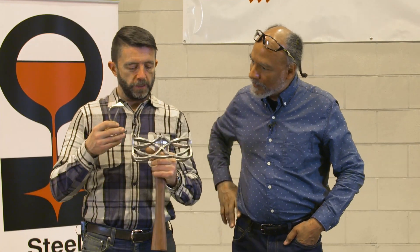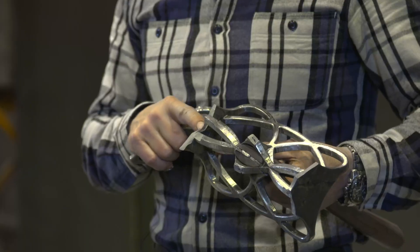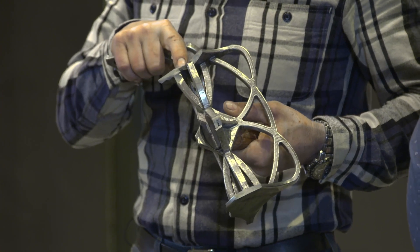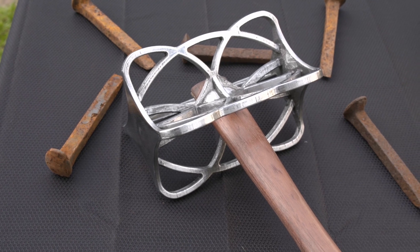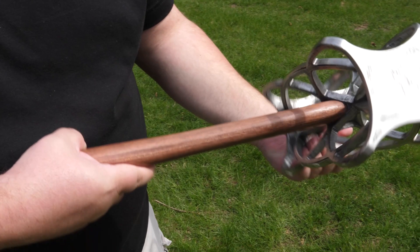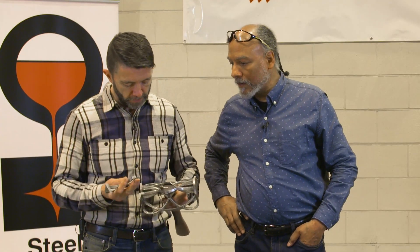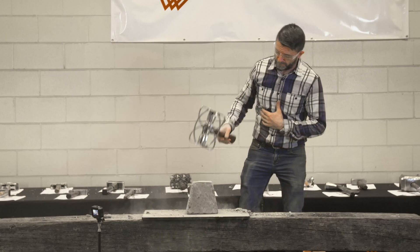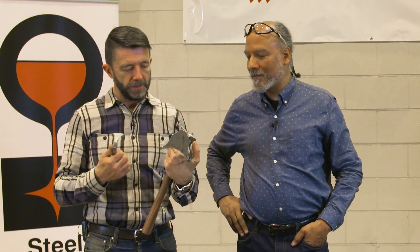You can see what happened to it. At all of the fracture points we see some centerline shrink. There's a darkness here which shows there probably was a crack already there — this is probably where the whole failure started, and then it just grew from there. From what I know of metallurgy, this is real fine grain — it looks like it's strongly made — but there are those centerline cracks and some shrinkage that caused an inherent weakness. While it was still swinging, this was a fun hammer to swing. It was light, it was fast, it was just a good time — and it's just a shame it blew up.